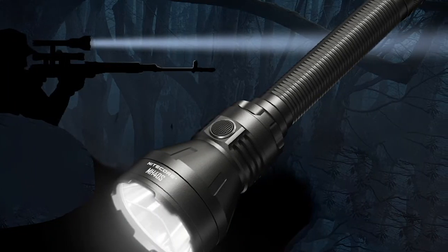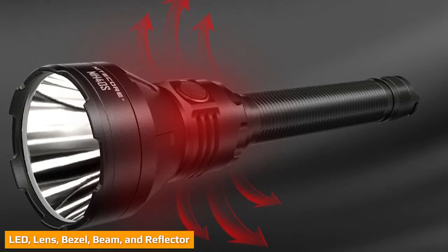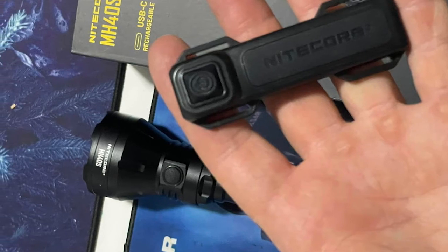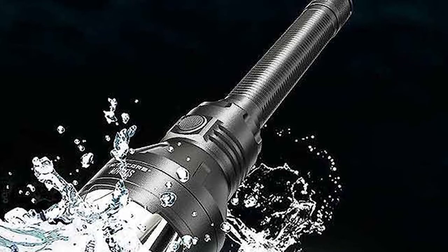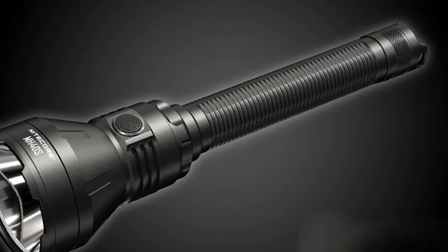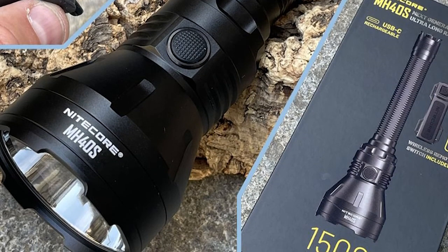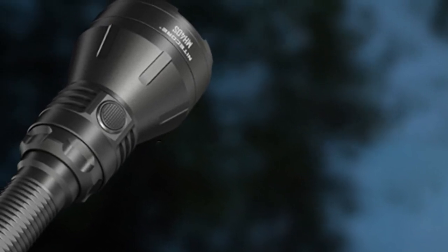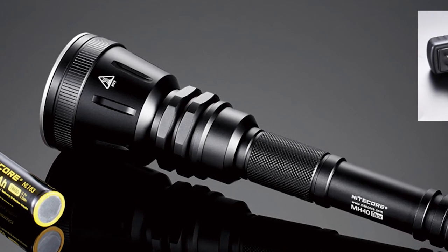The batteries did rattle quite a bit in the tube when shaken. Nitecore doesn't hold back the LED particulars of their flashlights, which is nice, and here's where it gets interesting. The MH40 and successor MH40TR both feature Cree LEDs — the XM-L2 and XP-L — but the MH40S goes a different route with a very different LED. Nitecore calls it the Lumen Engine 9, and it goes by the designation LSE 5050. This is a 3V 5050-size LED, featuring a round die covered by a tiny AR-coated glass lens. The round die is 1.6mm in diameter, for a total die size of around 2mm, which guarantees a very nice candela boost. Although Nitecore doesn't specify tint, we all know it's going to be cool white.